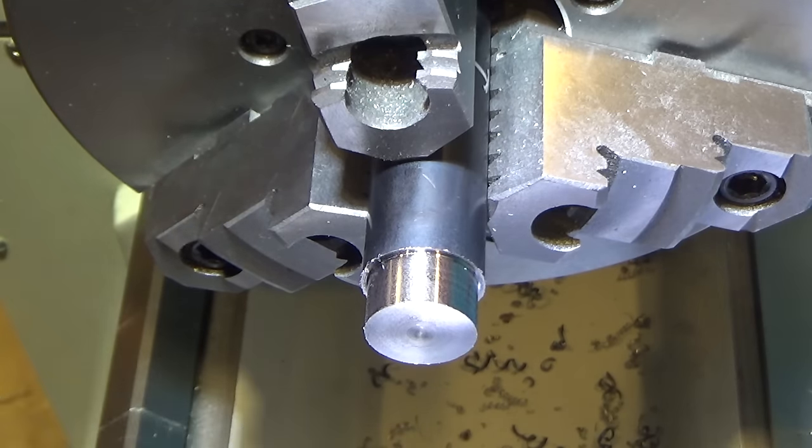And that is another improvement in finish. Higher speed seems to be better with this material. Boy, that is glass. And that's only the tempered stock. So, bigger bite, higher speed was an improvement, as the gentleman at Veteran Bicycle Company suggested.